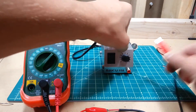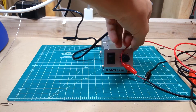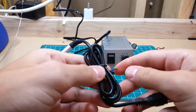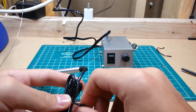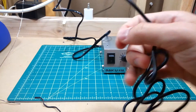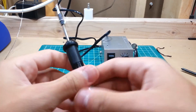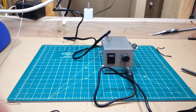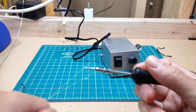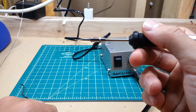Let's get this thing actually running and do some heat testing — see how long it takes to heat up — and then we'll do some soldering tests. Let's see if my Hakko's cooled down yet. Still toasty. We'll do a heat-up race — see which one heats up faster, this one or my Hakko. I bet it's gonna be the Hakko. This thing's actually quite comfortable to hold; that really fine pitch tip seems to be gold for doing rework. I might bring a couple of these to the Nova Labs Makerspace when I do my SMD class there.